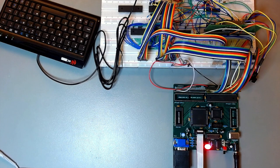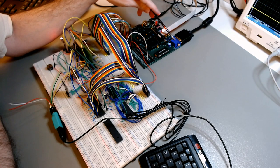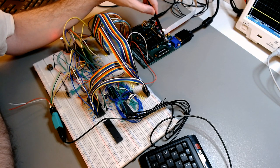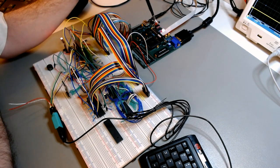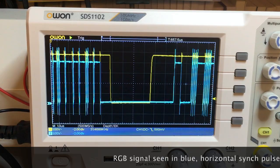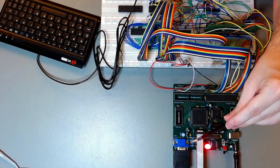I told you I was suspecting that my monitor seems to require more than 0.7 volts in the RGB signal. And 0.7 is the maximum value according to the VGA standard. But my monitors seemed to be draining more. That's why, in addition to the buffer, I added another transistor as a second buffer to push that voltage up. I thought maybe it's something I don't understand in the VGA standard. But no — there was an error. The RGB signal was still being sent even during the blanking interval, when you have the synchronization pulses. During the blanking interval, there is supposed to be no RGB signal — the RGB line is supposed to be grounded. But it was not.